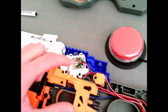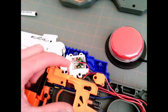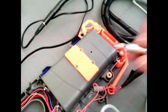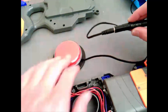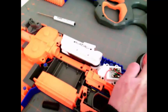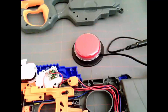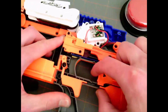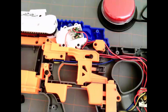You can see there are two positive red wires coming out here. One was in existence when we got the gun, and one is what I installed. When the switch is depressed, with those two wires connected to this female plug, you get power to the motor. Now the best thing about this, and this is why we decided to go this route instead of using a battery interrupter, is that the gun, when you depress all the safety features, will still work without the switch. And that's what I wanted to keep - some of the basic features, but also make it switch accessible.